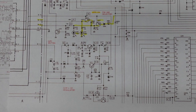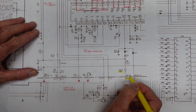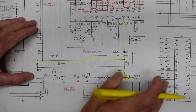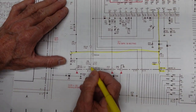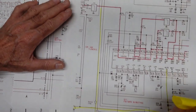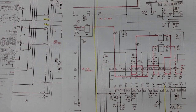If we look here, we have our AM coming in at B4 — that's our AM B+, going straight into our chip and also into the AM front end. Conversely, if we were in FM, our FM B+ is coming in here at B3. That's our 13 volts going up into our FM front end. Now we're going to pop the cover off and see if I'm right.